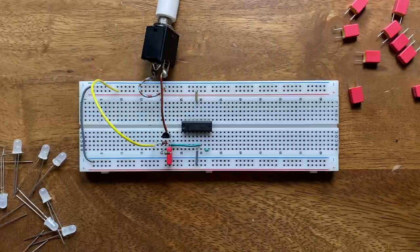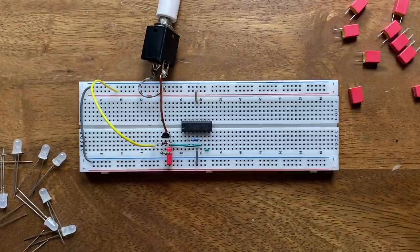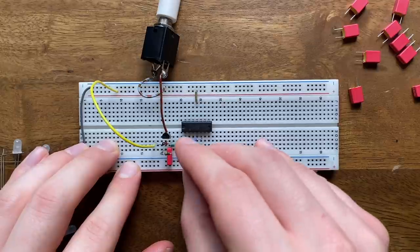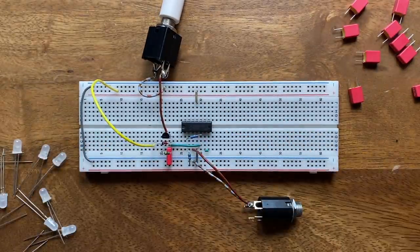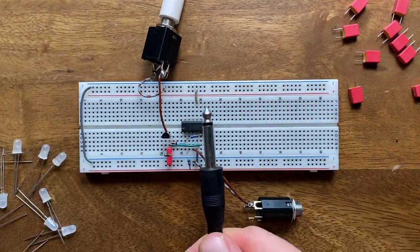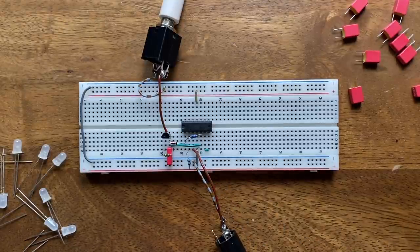Thankfully, we've got plenty of op amps left in our TL074. We get our threshold voltage with a 100k 33k resistor combination going from the positive rail to ground. Next, connect the non-inverting input to a jack socket and the comparator's output to our diode. Plug in a square wave oscillation as our trigger signal and we should see some action on the oscilloscope.